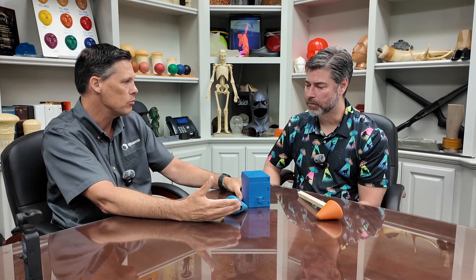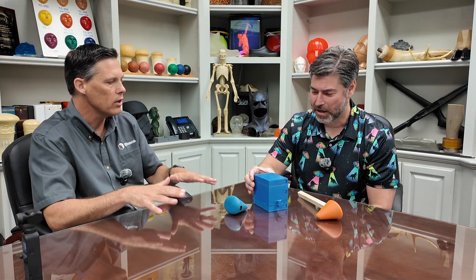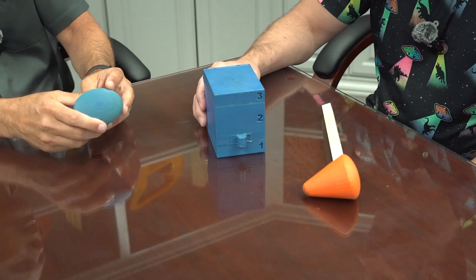For viewers considering this option: at what point does quantity push you to graduate from 3D-printed molds to filled resin or aluminum tooling? If you see this as continuous production for weeks, months, or years, invest in good tooling. But 3D-printed molds are great for prototyping or short-run production. If geometry needs to change, just print another one. The philosophy is to fail fast and fall forward, then look at production tooling. Legacy mold-making still makes a case at a certain point — but having 3D printing as an option lets you try things without being too scared about the consequences.